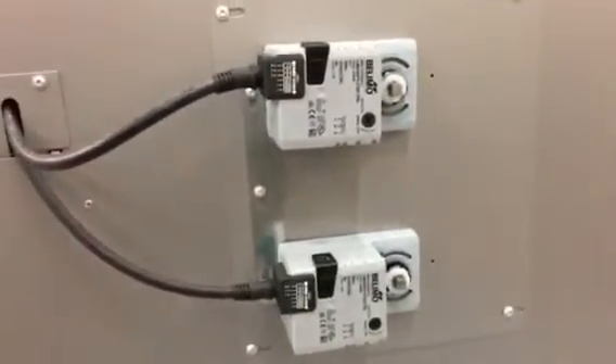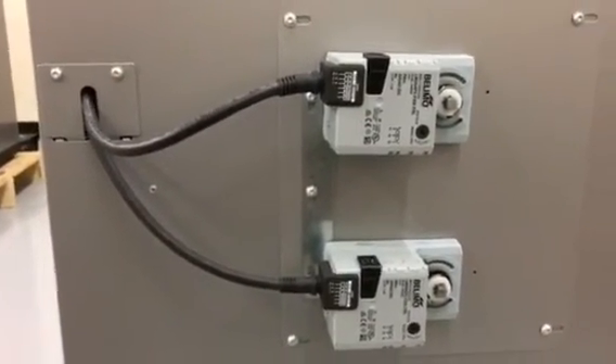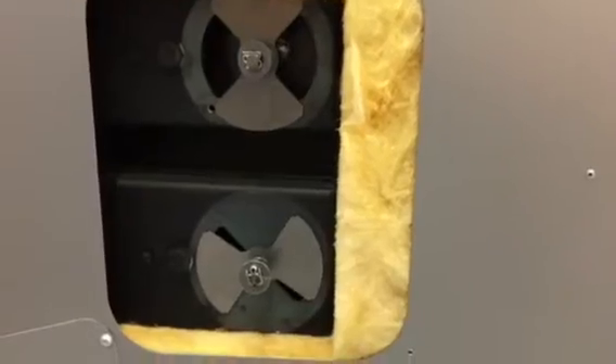Below that handle you will see the primary and secondary air dampers. These are connected to a rod that goes right through the back of the boiler, with a set of butterfly dampers on each side that these motors control. The cover has been removed from the other side so you can see these butterfly dampers — there's a matching set under the motors on the other side.